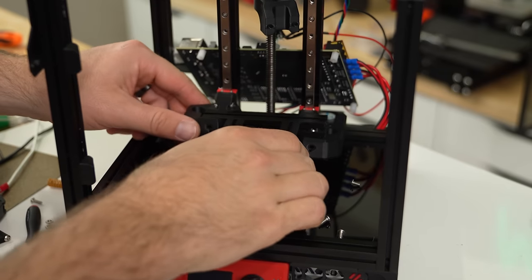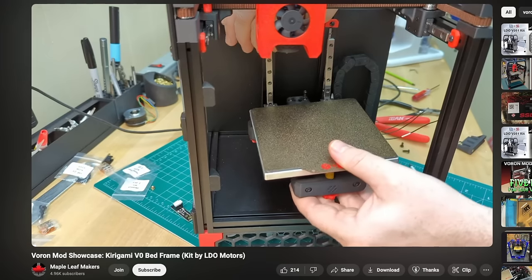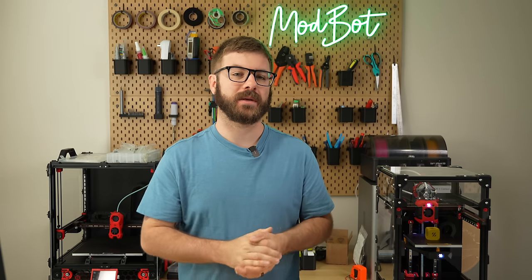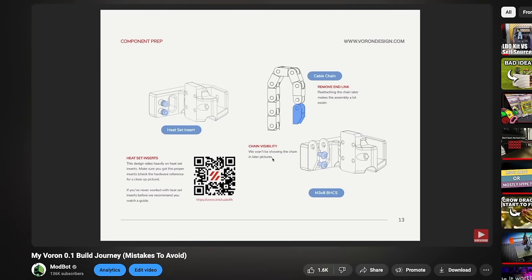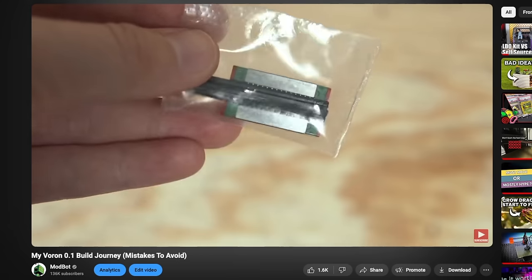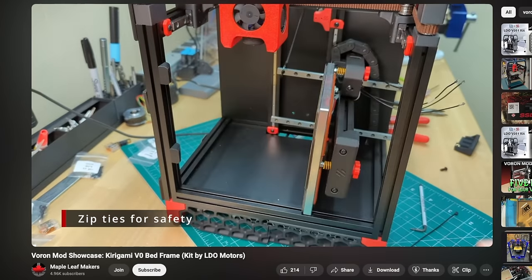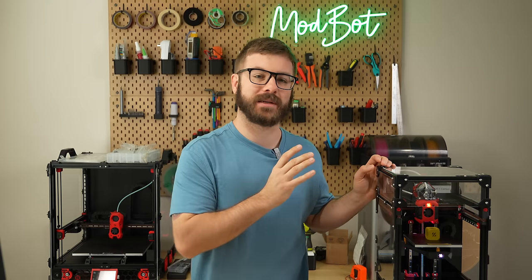This is probably the more tedious way, as it required detaching my controller and removing the back panel to gain access to the screws holding the bed assembly in place. The second method, covered by Maple Leaf Makers, has you remove the Z-rails from the vertical Z-extrusions and then disassemble the bed. I have some serious PTSD from a previous V0 build where a Z-bearing block fell off the rail and I lost a handful of bearings. As long as you've got rail stops or zip ties so the bearing block cannot fall off, that is the method I recommend — it's just the easier route.